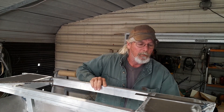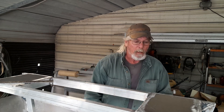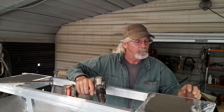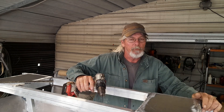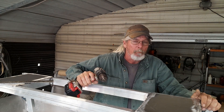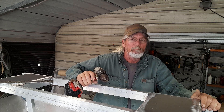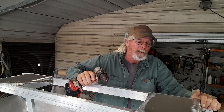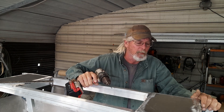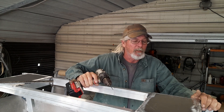All right guys, we got the top side of our engine stand all finished up. We got our holes laid out for our bolt pattern for the engines. Take note that the hole pattern on the base of the engine is 5mm off-center. Keep that into consideration for when you're needing your shaft to be in the exact spot.